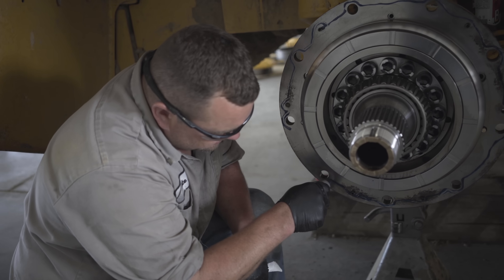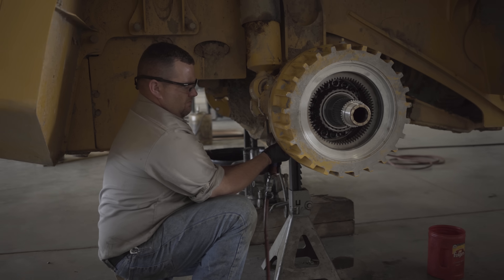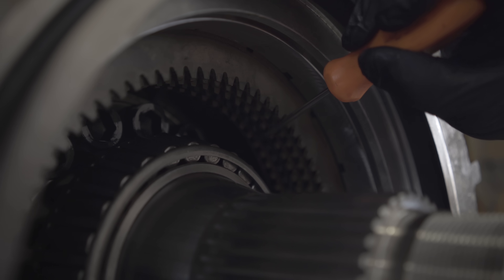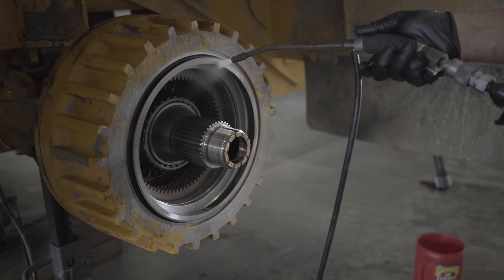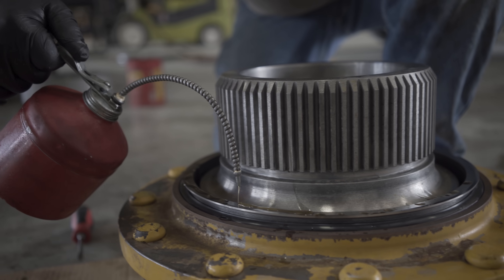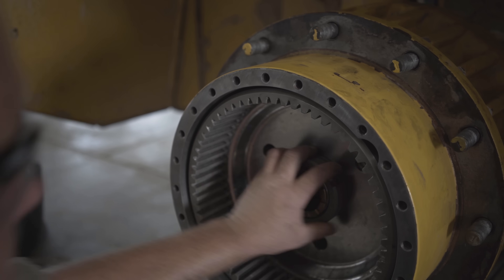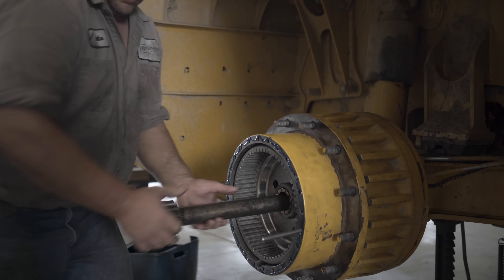Give this one last wipe down and we're going to apply this flange sealant. The starting fluid will give it a little bit of lubrication and then it will evaporate. Now we're lining up our friction discs, and they have to be lined up absolutely perfect — if not, you have a heck of a time getting that hub on. We have to ensure that the mating surface of this seal and that seal are perfectly clean. Apply clean oil to the mating surface, install this retaining keeper, apply some flange sealant, install the axle, and install the final drive. Boom!